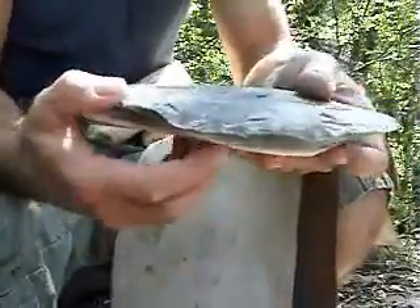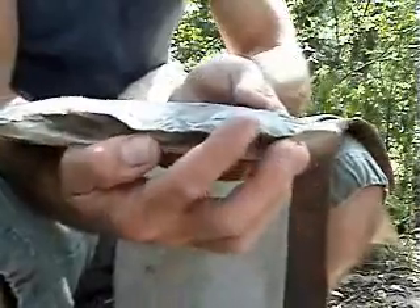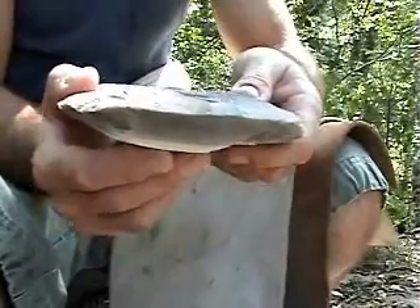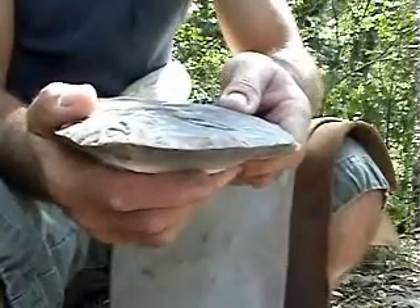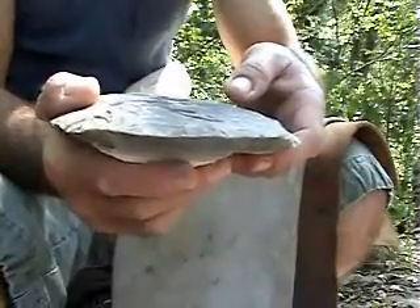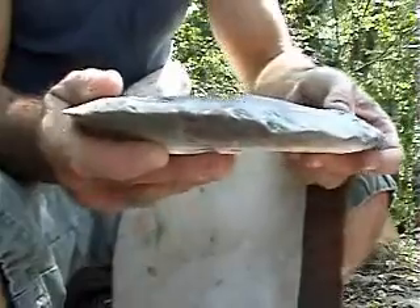I'm going to blend that over here. This edge is still a little high, so I'll blend that back down. And as we work around the blade, you can see a little length needs to be lost in order to bring that to below center line or at center line in order to really drive in here. Being liberal with losing a little bit of length early and knowing when to stop — it's a juggling act, but something you figure out with experience.